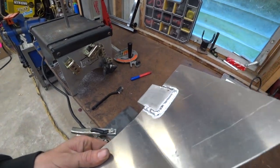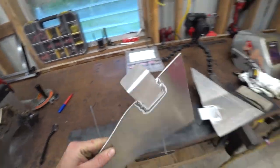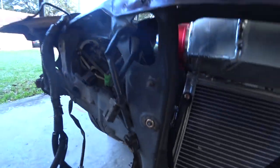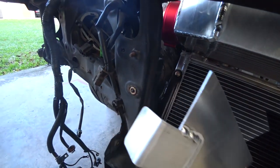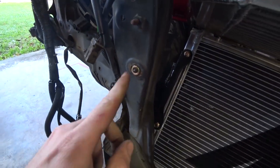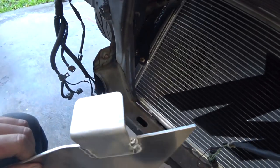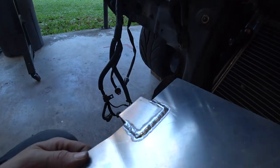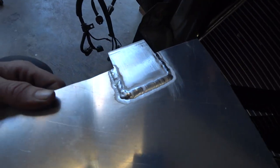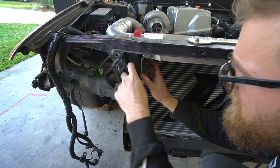All right, we've got our little brackets welded on our plates, and I threw these riv nuts in. Got a transfer punch in there, so we'll put this into position, give it a little tap with the hammer. That should transfer a punch spot to our bracket here for us to drill and everything be perfectly lined up. That's the plan, at least. Also, welding at lower amperage works way better. Who would have known?